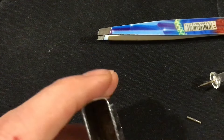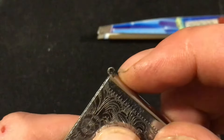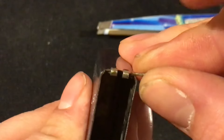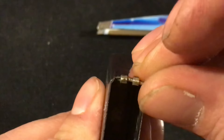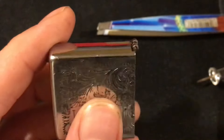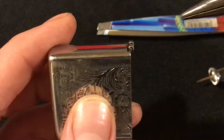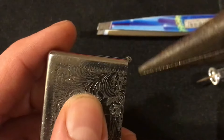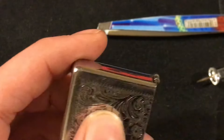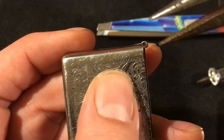Take the insert out so we can work on this. The reason your hinge is loose: these rings have been stretched out over time, so the pin fits loose in there — there's room for it to play everywhere. What you've got to do is stick your pin in and tighten these rings properly. I'm gonna show you how with the pin in so you don't over-tighten them, because if you over-tighten them you can't fit the pin back in. You'll see the gap close to the case — that's where your squeeze point is, and you curl it back around the pin.